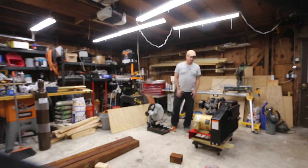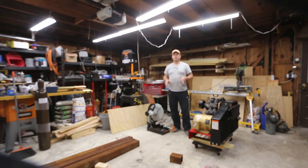So anyway, I'm going to build a stand for these. What I'm going to do is set them up in duplexing. Now, most people run duplexing compressors where one kicks in, and if the air demand continues to be too high, the second one kicks in. And that's not my purpose. My purpose is redundancy. So I'm going to set them up where one runs and then the other runs. And eventually I'll build a controller for them.